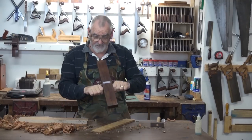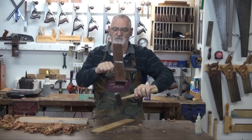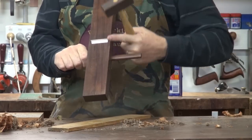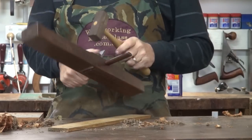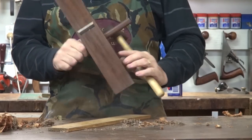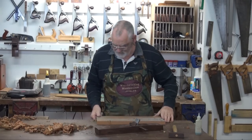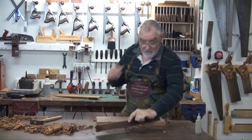That's got a little bit too much coming out — that's going to be too aggressive. So just with your hammer, sight down the sole of the plane and give it a couple of little taps on the back. Knock the wedge in and put your job back in.